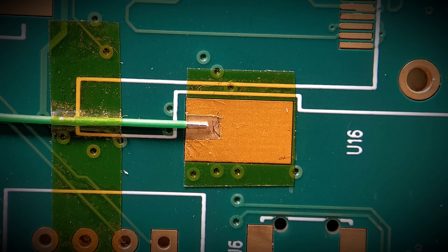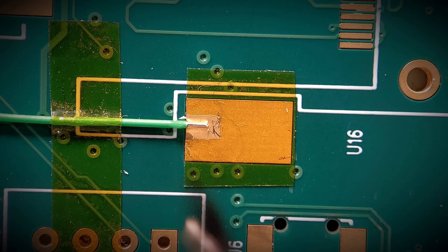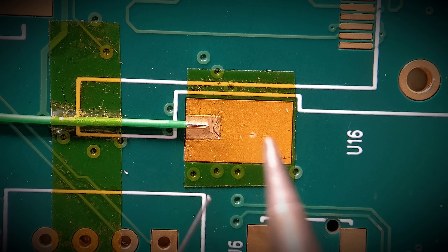What I'm going to do on this one is just get a small amount of flux added to the joint, and quickly get this solder up. It's not critical on a lot of boards, but in some cases too much solder or too much solder flow can cause you issues. So yeah, it's just a good method where the Kapton can really help you.